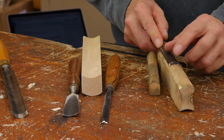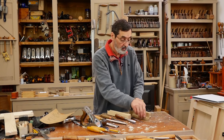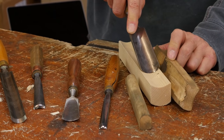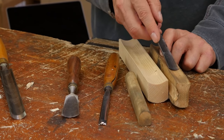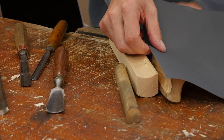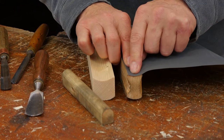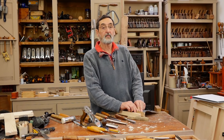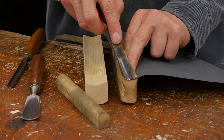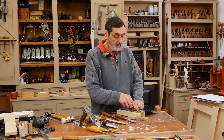You can actually use a shallower gouge on this too — it doesn't have to conform exactly. We also need a hollow here so we can take a wider hollow for a wider gouge and rotate into the wood. Put the abrasive paper inside. It doesn't have to be glued down but you can use double-sided tape. You'd start with coarse, then go to fine, superfine, and so on. When working, pull this in this direction — don't push it into the surface or it will rip your paper.